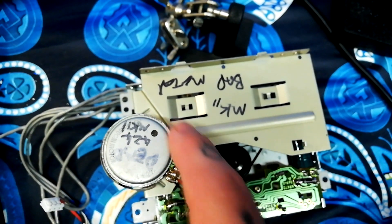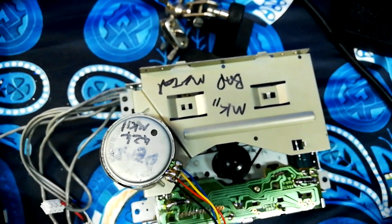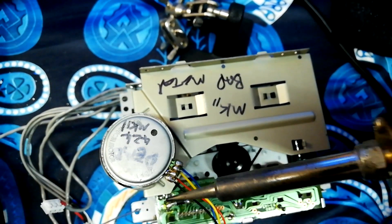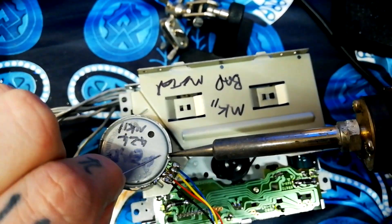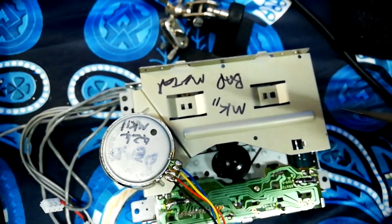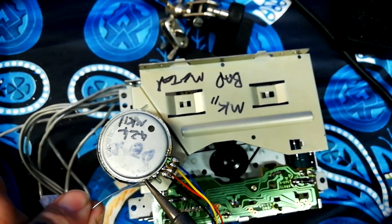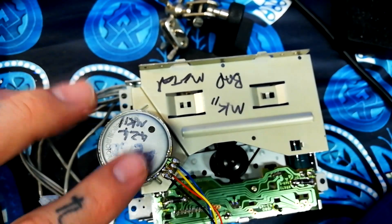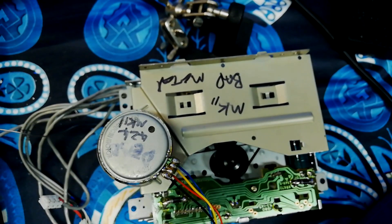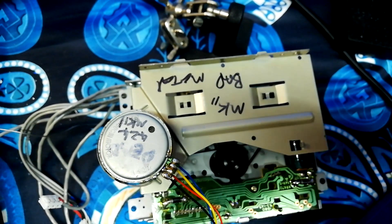Just to ensure that we don't lose the physical connection between that brass heat sink plate and the motor control chip, I'll introduce a little bit of rosin around the edge and put a little bit of solder here so it doesn't come loose. A big bit of metal like this I'm probably going to want to heat for a while — there we go. Maybe I'll put a little bit more here; that should stay where it is.